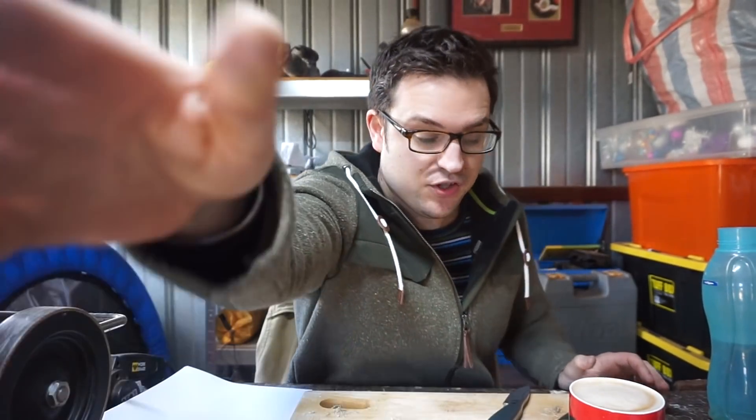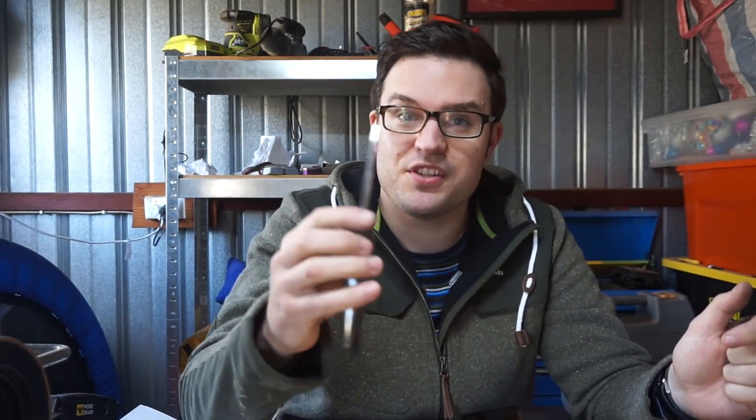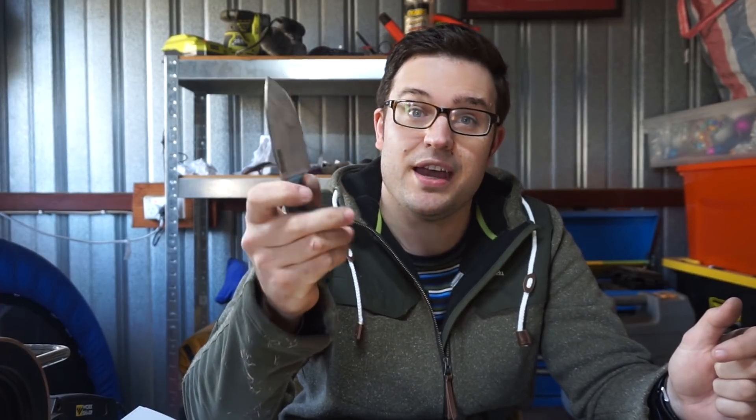You've probably noticed the last video in this series about these nitrogen steels was a little more subdued — just getting some basics underway, standard kind of edges, WorkSharp as my baseline, and then a nice coarse standard factory finish at 17 degrees. Just to refresh: the Z-Finite steel cut 230 with the WorkSharp edge, and 390 with the V-ground 600 grit edge. The Vanax cut 300 with the WorkSharp edge, and 550 with the coarse edge.